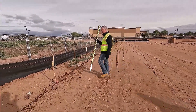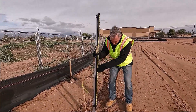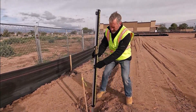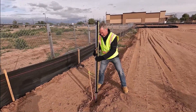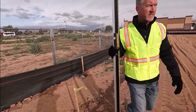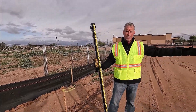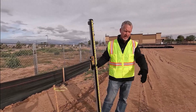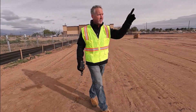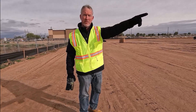I've put the grade on my x-axis and I'm checking my y-axis — it's still zeroed out. What that tells me is that my laser is squared up, because I didn't have to make any adjustment to the y-axis — the grade has not changed when it's only on the 90-degree axis. I'm going to check myself once more on the projected slope that the surveyor gave me, just as a final check before doing any dirt work.